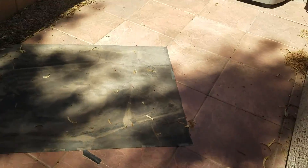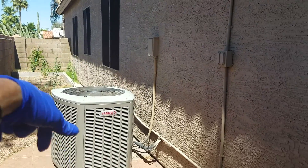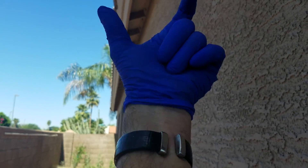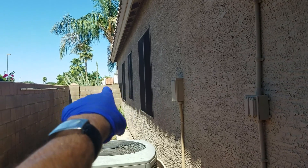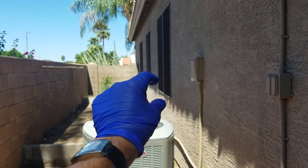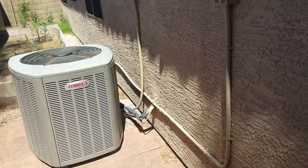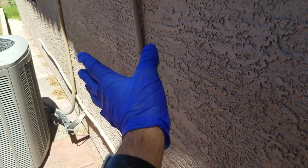Going outside. I've already walked this property. I'm recommending 6-inch aluminum seamless rain gutters on the side of this house, with the brackets to hold the gutter out level, and the downspout just on the other side of that fence. A little bit more dirt grading in the front to allow water to flow away. A 6-inch gutter with a 6-inch downspout and a 4-foot 6-inch downspout extension, with dirt grading on this side. We need to remove this water from this area that is being pounded and forced up against this house, because water vapor is going underneath this shallow foundation.